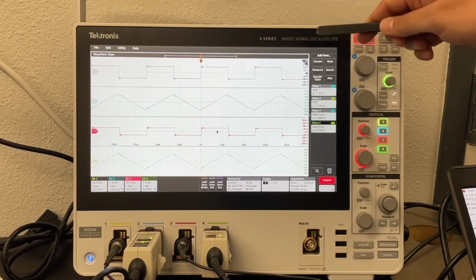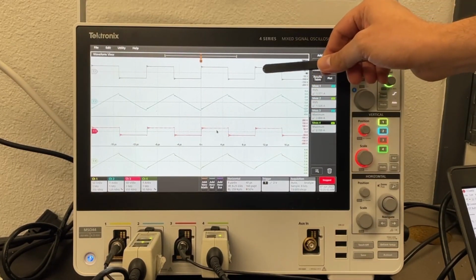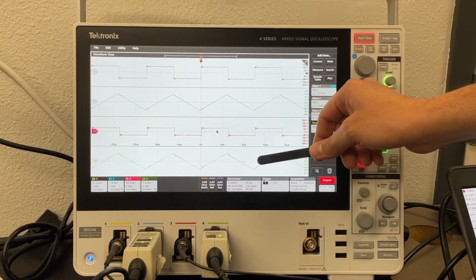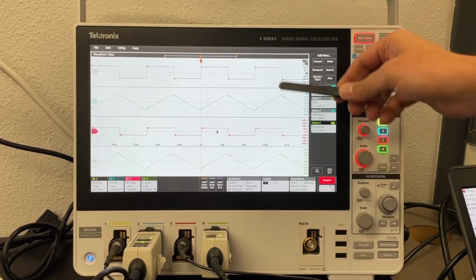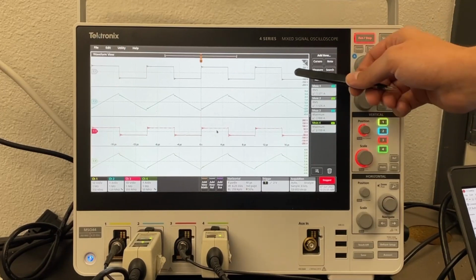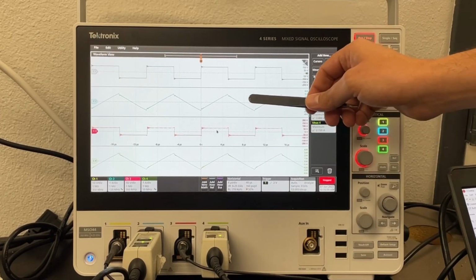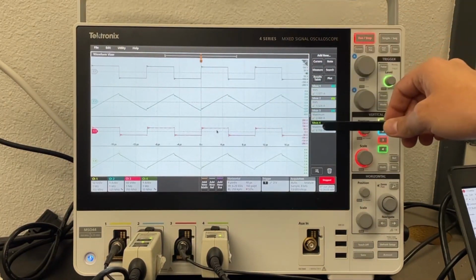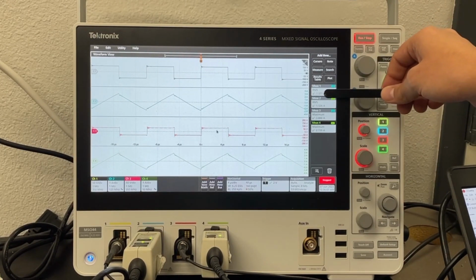Here we have the 4 waveforms. This is the primary voltage, primary current, secondary voltage, and the secondary current. For conventional modulation, we have the half voltage gain. We were converting 100 volts to 50 volts. And as you can see, the current waveforms are highly peaky with a maximum of 2.8 amperes and the RMS of 1.5 amperes.